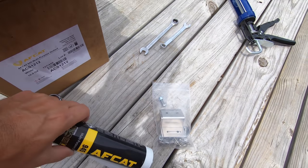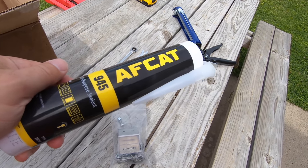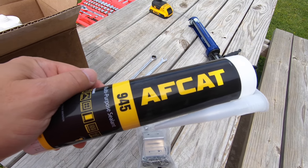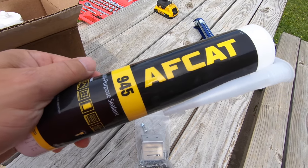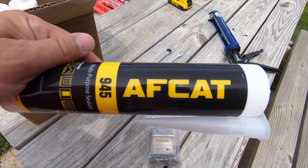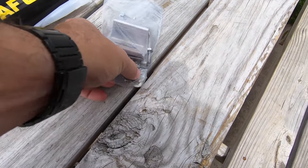I decided to use some sealant that Todd recommended. That's a special non-shrinking sealant, so it's not like Dicor that shrinks. What I did is I put that underneath the feet, and then I screwed through those, through the sealant, and then I put some Eternabond tape on top. This is fine for TPO roofs, but it does not shrink, but it's also not self-leveling. So I'll have to smooth that out a bit, but this should be good for what I'm doing there, where I'm taking these screws into our roof.